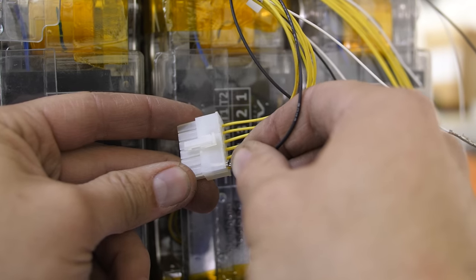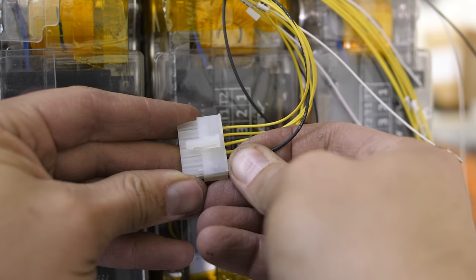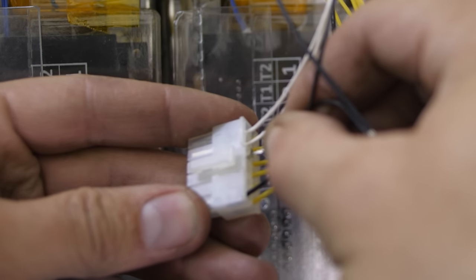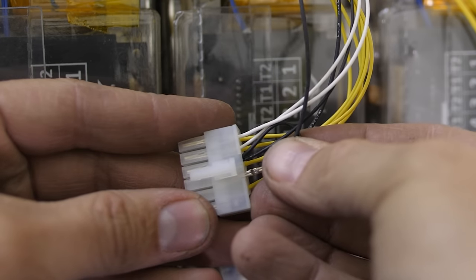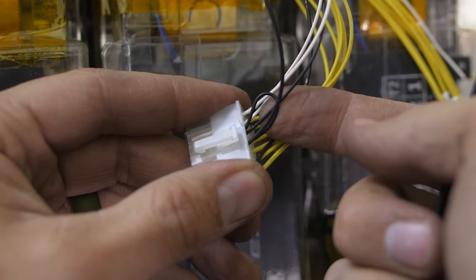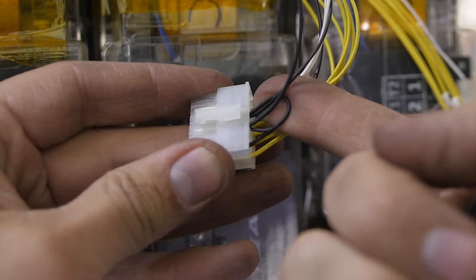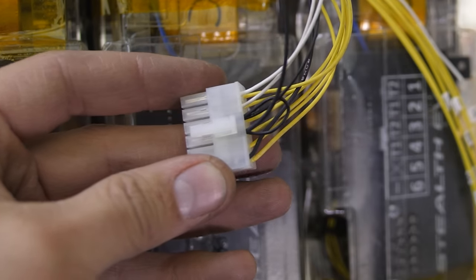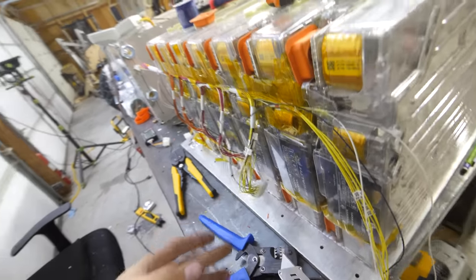Finally we get to the grounding wires. The ground for the cell tap colored wires is just a singular wire and handles the next 12 yellow wires. The ground for the thermistor needs to be daisy chained for the other thermistor in this battery module as well as the two thermistors in the final module — that ground is distributed to all five thermistors. It's a little more work, but takes less space inside the battery box. And we are done — all of the wires are in their connector and ready to be plugged into the BMS board.